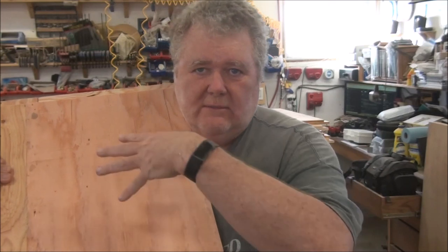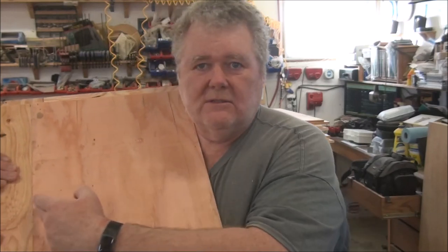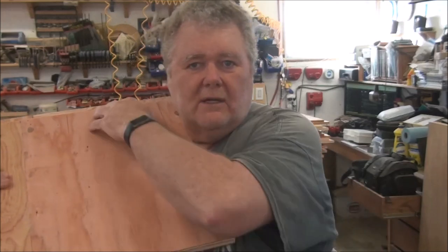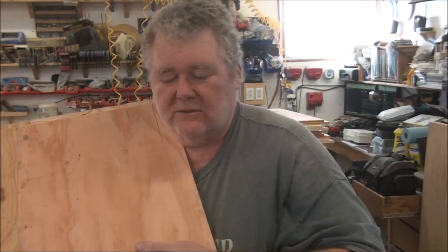So when this material gets wet, humidity or rain or something, or it gets dry, low humidity, heavy sunshine, because this is going to be outdoors, the expansion and contraction will be in this direction. Okay, and this being a hive cover, that will be across the hive, not end-to-end. That's about 4 inches difference in a Langstroth hive. I've talked about that before.